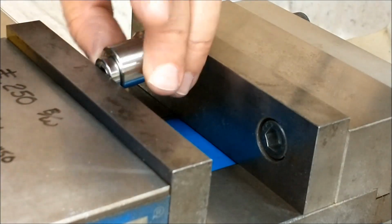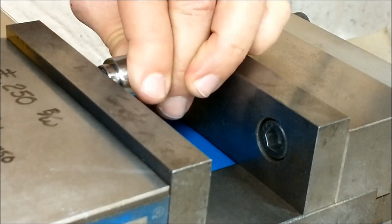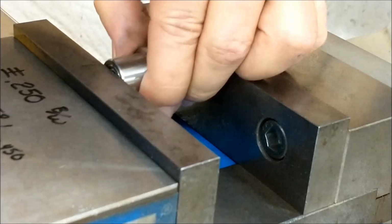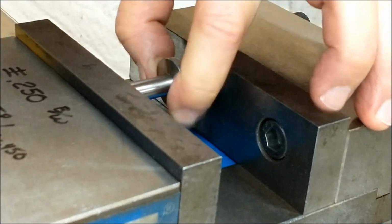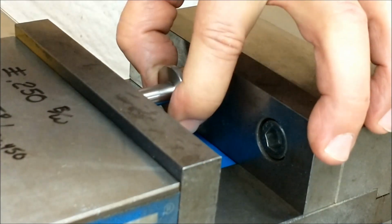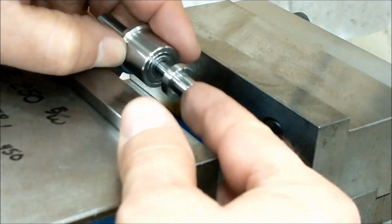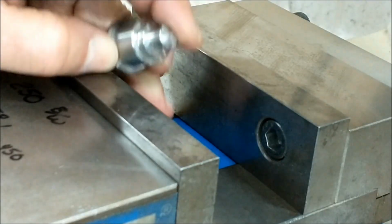Third step is to take the second bearing and just bump it right now. Look for it, because if you're off center, you're going to start to drag the sides of the body. You don't want to do that. Bump it until you know it's going to locate, and then flip it around and sink it home. This is going to squeeze both bearings against that spacer and give you a nice registration on all. Now you can't tell that's spinning, but it is.